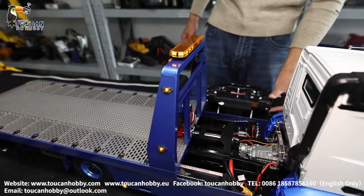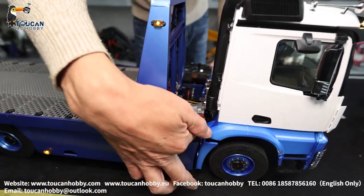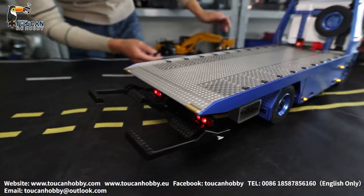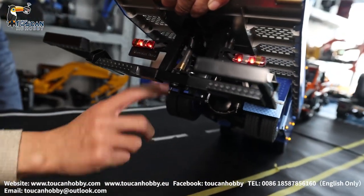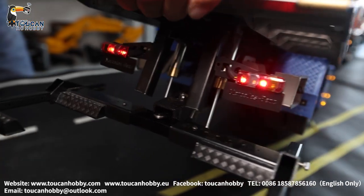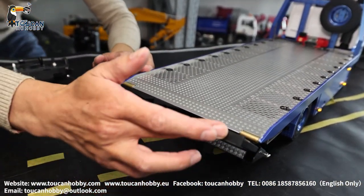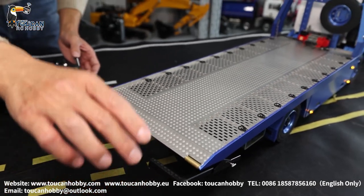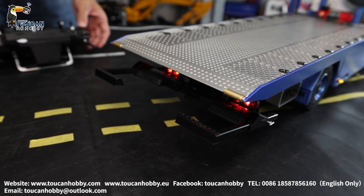Let's take it back. So the battery wires - if the battery wires are on top here, they will get stuck. Push them down. Now we see the rear side from here. That's the light. If you move down, you can see more clearly. I'll lift up from here - you will see the two cylinders for lifting up and down. That's the most low position. Every time you put it up, if you see from this angle, at this position it is already blocking this plate. The plate cannot move back because we are touching. So every time you want to move this plate to the rear side, first you lower down this bar a little bit, then you can move this one in.